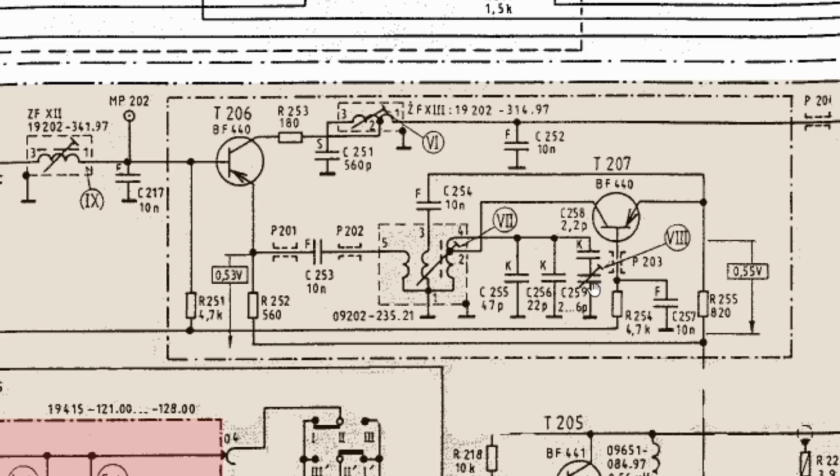And the best way to do that is you've got a tank circuit, as usual. Here's an inductor, a couple of fixed caps, and a tuning cap. This tuning cap, you want very little effect of it. So they put it isolated with another capacitor, which, because of the way you add series capacitances, actually reduces the range of this one. But what they tell us to do, let's have a look at the instructions.